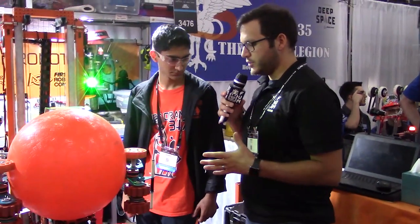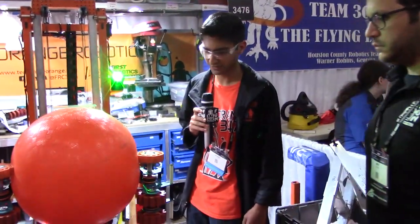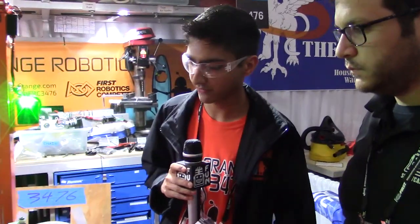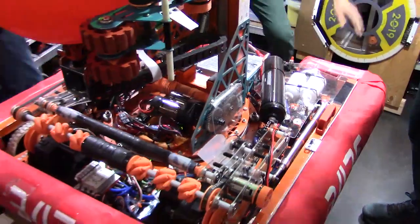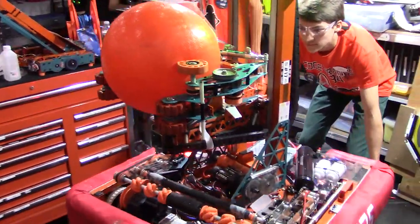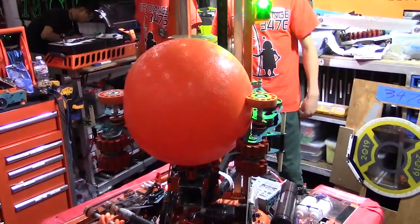Ashwin, I want to talk to you about automation and how all of this fits together. So this robot is very complicated — there are a lot of moving parts, and we have to automate a lot of things to make it easy to use during driver control. One of the first things we did is implement a field-relative turret, which we can demonstrate right now. The turret will maintain its heading regardless of the drive base's heading, so the operator can have the turret in the right place when ready to score, and when the driver gets there, we're already ready to eject a ball.